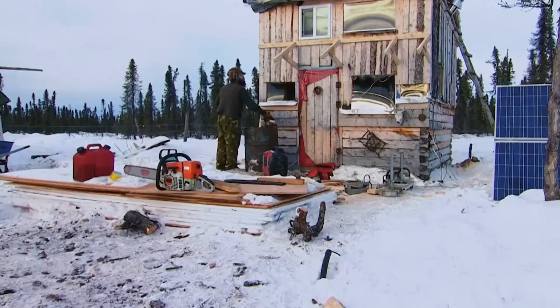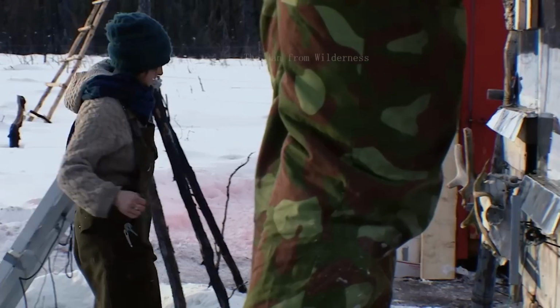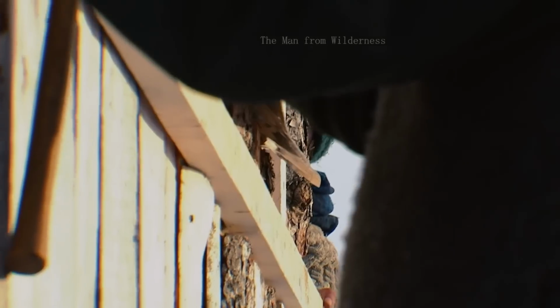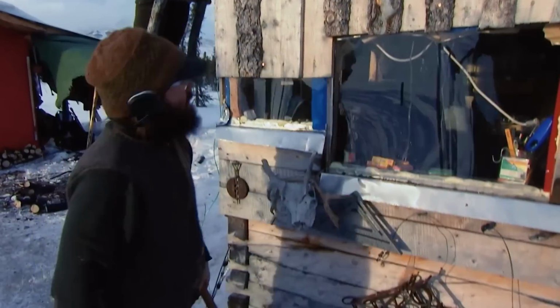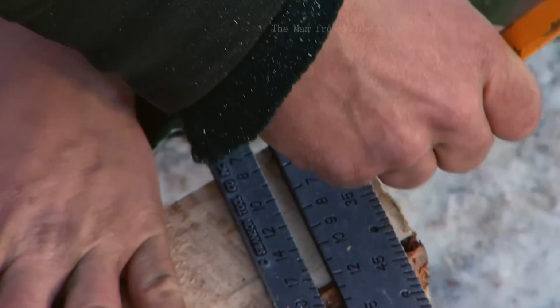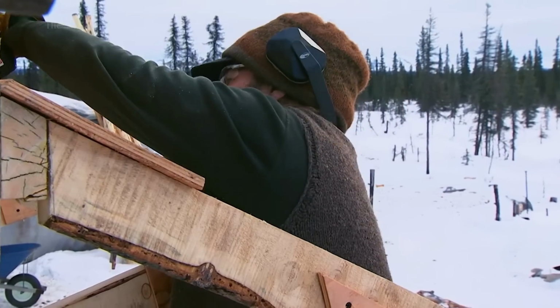He sped up his work. Marge came over to help. Together, they fitted the boards into the notch. Morgan secured them with nails, then drilled several screw holes in the wood. He connected several wooden bars diagonally to the boards as the base of the frame. A triangular shape is the most stable structure, so Morgan used this design to create a sturdy frame.